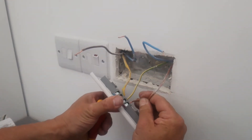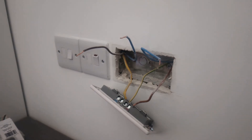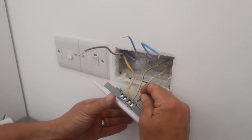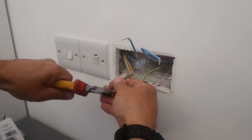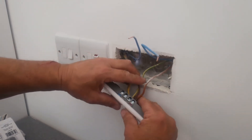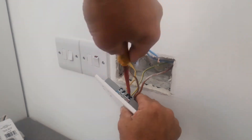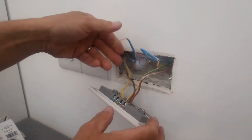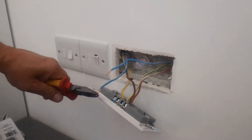As you can see they stick out quite a bit, so I might just trim those down slightly. I'm just going to get some cutters. What I'll do is trim off a little bit of cable so when it goes in there it will sit up to the insulation. Put the two lives in — or the line conductors. A little pull just to make sure they're in there. Same with the neutrals — trim these down just a little bit, because you only cut a very small bit off.